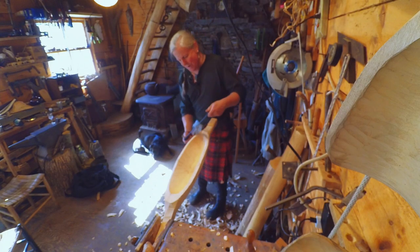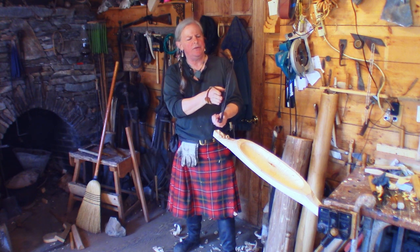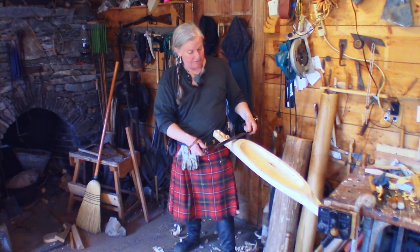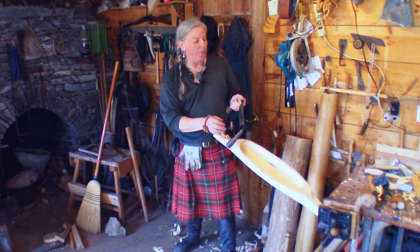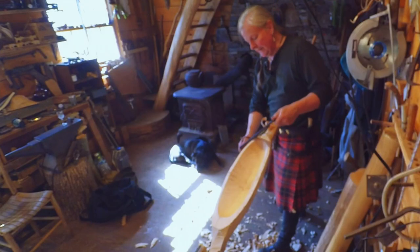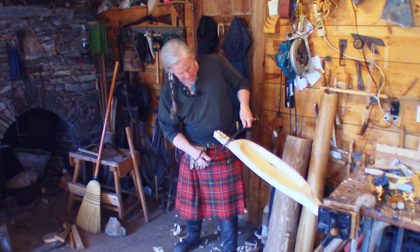So now, working on the bottom half, the belly of the beast. The blade is beveled down. One side of the blade is flat, and I use that for the most part like a plane, traveling across the surface on that flat, and the wood peels up from the angle of the bevel cut. But it's not a hard bevel, it's kind of a rounded bevel, so I can flip it over and use it like my bent gouge that I was using earlier to scoop out hollows, inside curves like this.